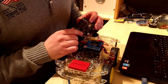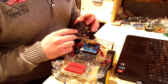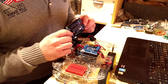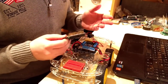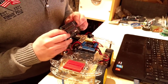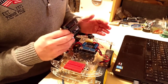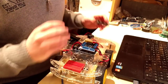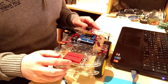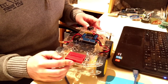With hardware-in-the-loop testing, this now becomes an automated, faster, and safer process. We have the first microcontroller running our system software. The second is providing the production environment's input signals — in our case the UART commands. Our hardware-in-the-loop simulation microcontroller monitors and verifies the reaction or output signals of the system under test and lets us know if this is the expected behavior. Specifically, to test the smart car, we make sure that for each UART command, our system outputs the correct PWM signal for steering and sets the various pins to the appropriate state for throttling.